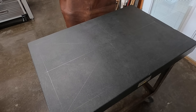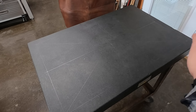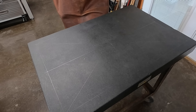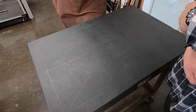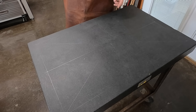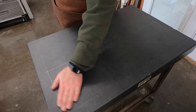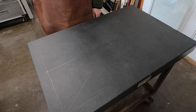The difference was mine was like 2.2 thousandths — it was a crater in granite terms — so we actually have a pretty decent plate here. This would be usable as it is. You know, I've done quite a few measurements on the channel sharing things especially like those straight edges — I mentioned they're not verified so I don't know how right they are, but I was measuring a half a thousandth variation. Worst case scenario you had an error of about two tenths. We need to put the repeatometer on this because we also need to look at local flatness, not just overall flatness, to fully grade it.